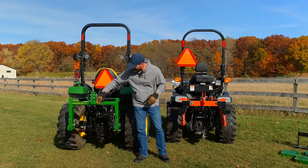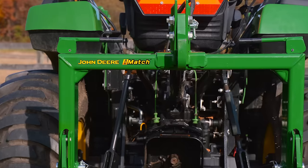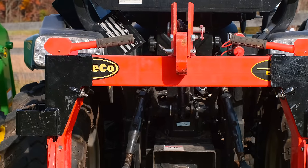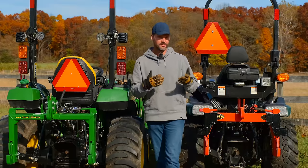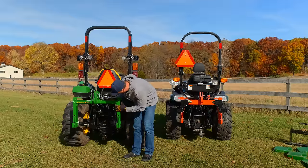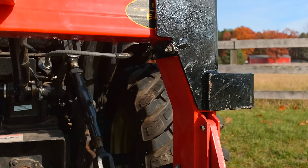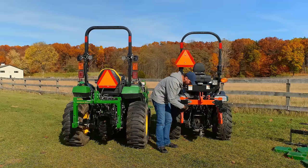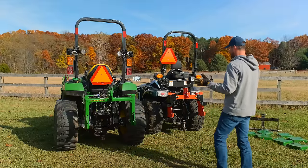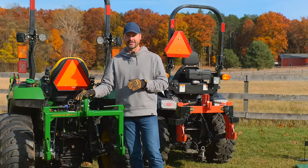Just visually looking at these units — take a look at the steel. You can see the thickness of the tube steel here compared to the Speco. Substantial difference there: thicker square tubing versus thinner rectangular tubing. Perhaps this is a heavier gauge given the weight is still about the same, but an interesting observation nonetheless. Also take a look at the gusseting — or almost lack of gusseting — on the John Deere iMatch. Really small: just a tiny little wedge in each corner. The hitchhanger follows the line of the gusset all the way up, giving it more rigidity.